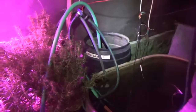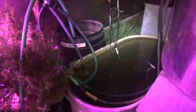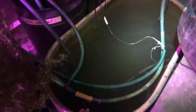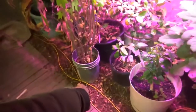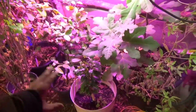The main reason I flipped the camera on tonight was I was playing around with some upgrades I want to do to the thermal mass heat loop system. I was thinking about putting a couple of solenoids in line with the single pump to make it so I could circulate through the coil either directly back to this tank, or bypass this tank and send the heat straight from the coil to the secondary barrels, then through the loop, and possibly bypass the barrels and go right to the loop with heat off the coil for better control over warming these beds and keeping plant comfort.